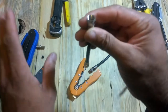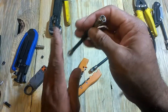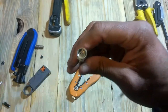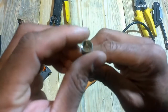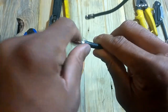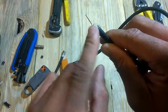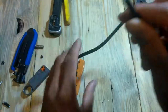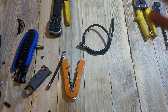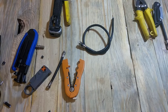These crimp connectors — no professional should be using these outdoors, especially in a moist climate with snow or a lot of rain. Moisture is just going to get up in there and corrode it. It can possibly damage your TV because once this thing starts to corrode, the outside braided layer and the stinger start touching each other due to corrosion — the dielectric just disappears, falls apart, and it all corrodes. I've seen a lot of this out in the field. But that is it, folks. If you have any questions on tools or any type of coaxial tricks, hit me up in the comment section. I'll talk to you guys next time.